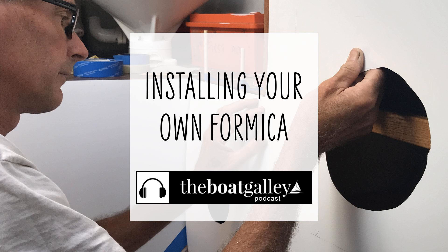Now here comes the interesting piece: you position dowels to help keep the surfaces apart. These are just regular wooden dowels from a hardware store. The contact cement — once it's let dry for 15 minutes — is mostly dry to the touch; your finger won't really stick to it, but the contact cement will stick to itself. The dowels have little enough surface area that they won't stick to the contact cement. So you position the dowels on the surface you're laying the Formica onto, position the Formica over the dowels, then carefully remove the dowels one at a time — pressing one edge and working the dowel out — working from one edge over to press the Formica into place.